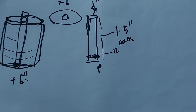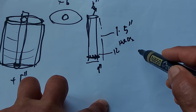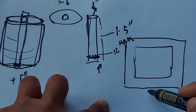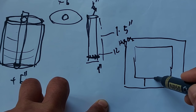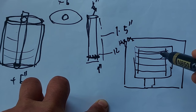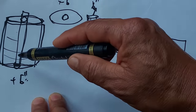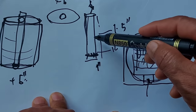That's the main tools we need. Then we need to prepare the base of the kiln. Normally we use brick to build it up. There's a hole underneath, and inside we're going to put a strainer or metal rack so the air can go in. On top, we can put wood here. This base needs to be big enough for the oil drum to rest on, so the oil drum will be over this rack and the pipe will be in the center.